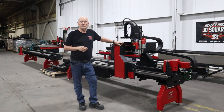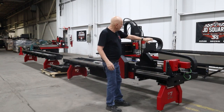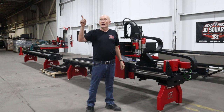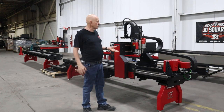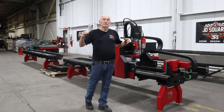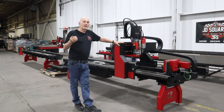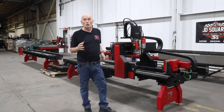That brings us to the XR6. Why, if I liked the RC6 so much, did I change it? It has a lot to do with a drill head option we're currently developing — we hope to be done in the next few weeks. A large number of customers want to be able to drill and tap holes, because you cannot plasma cut or laser cut a hole you can then tap. To mount a drill, the entire structure had to become heavy, robust, and rigid, which meant going from a cantilever machine to a gantry machine. That also brought a tremendous number of advantages, including a new drive system using Yaskawa servo motors — some of the world's best.